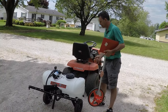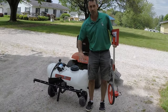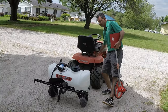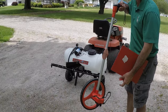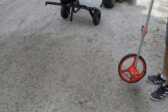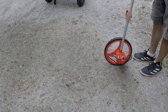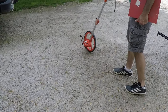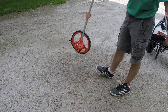What you do first is kick it on and let it spray plain water to see what kind of distance you're covering. Then shut it off and measure your effective spray area. Using a measuring wheel, start just inside where you see it wet — because the outer edge is too light to be effective — and measure across. This one is about eight feet, so eight feet is our spray width.